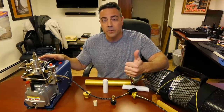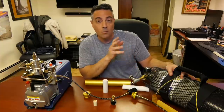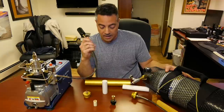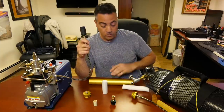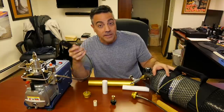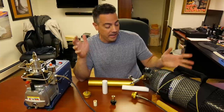One thing we can all do to be safe is have our tanks inspected. The scuba guy said for $10 they'll let all the air out, open it up, send a camera inside, and visually inspect for any rust splattering. Aluminum doesn't rust — it pits. You might see a little rust from components but you'll really see the pitting: is it droplets or splattered? They can determine if there are any issues with the tanks.